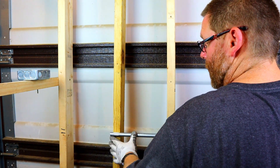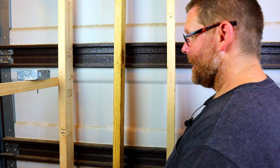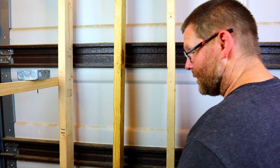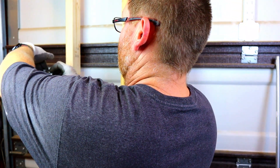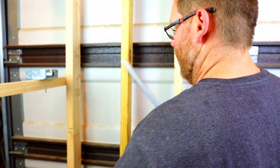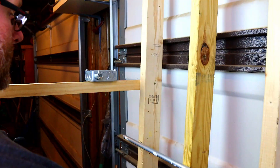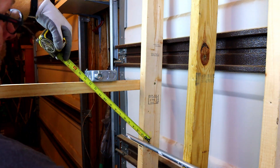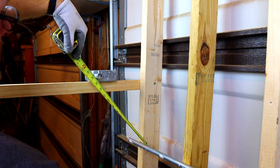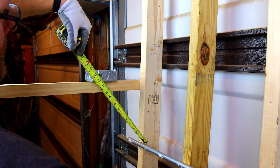So the conduit is coming in here and we need to get to the box. What I suggest until you learn how to do this is to take a scrap piece of conduit. You already know where your line is — if you don't, measure from something to find it. Put your connector in first. Take your scrap piece, hold it past the connector, make sure it's level, and you get your measurement. I got right about 13 and an eighth — we're going to use 13 for this one.